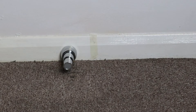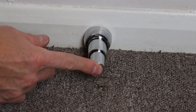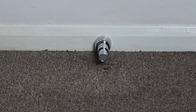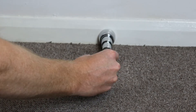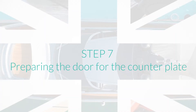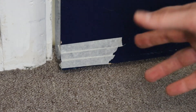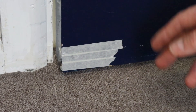The magnetic doorstop is now securely held in position. You can see the rotational feature of the magnetic doorstop, which allows for the door angle - we'll see this when we fit the corresponding part onto the door. The next step is to take the corresponding magnetic part and carefully position it on the end of the magnetic doorstop. On the door I've put some masking tape at the point where the corresponding part needs to fix, which will allow me to accurately mark its location.